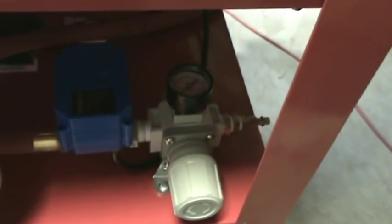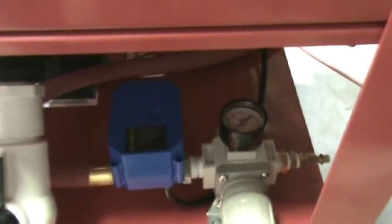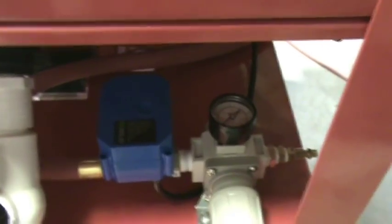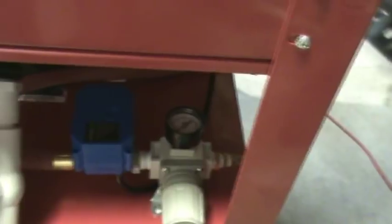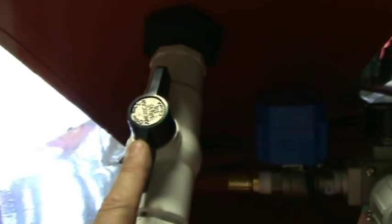For the air, I'm using a 200 PSI regulator into an electronic ball valve. I went with a ball valve instead of a regular solenoid valve because the ball valve ensures I'll get the CFM flow through the airlines — solenoid valves can handle the pressure but just don't have the flow-through you need. I also added a skimmer valve almost like a pool skimmer to skim the top surface of the water where oil and everything floats, draining into the bin down below.